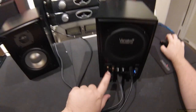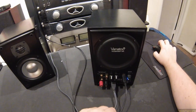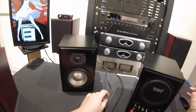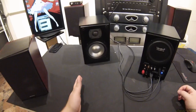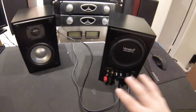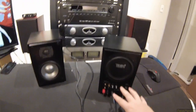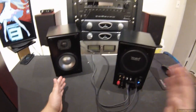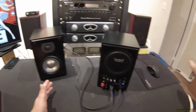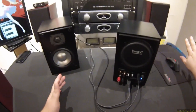You get to choose between 32 kilohertz, 44.1, 48, and 96. Oh, the analog input here and the digital input here, there's no DAC built into this. So if I said that earlier and I don't recall, I lied. This doesn't take digital to analog for the amplifier. The amplifier internal is digital. It's a digital amplifier. And it takes a digital signal and it leaves it digital, and then it just becomes amplified. It's a tough nut to explain.